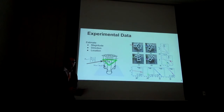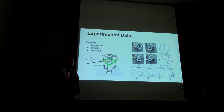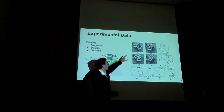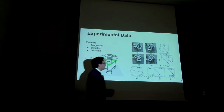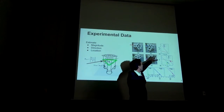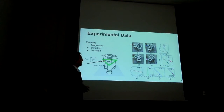So to test the whole body contact sensing capabilities, we apply forces to all sides of the platform. So here we see a platform, we rotate it in different ways, put it in front of the test dummy, and then we launch it with a given force. And then we can see several charts over here. In here we see the contact forces in the different directions. We're actually providing the same forces, I think about 10 newtons. So we have some variability, but relatively high fidelity measurements.